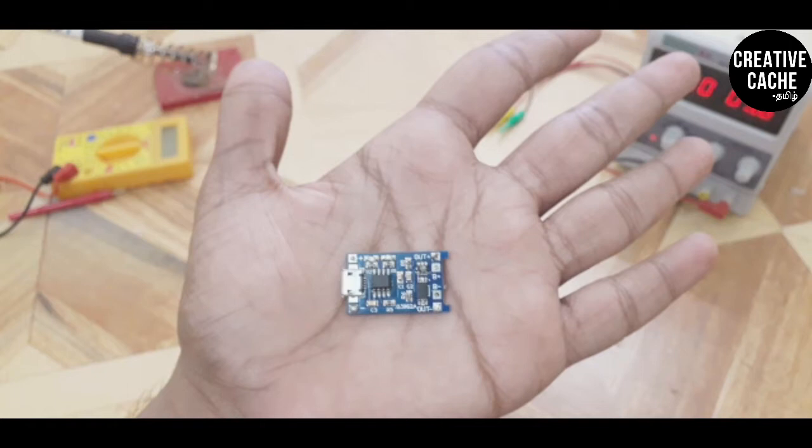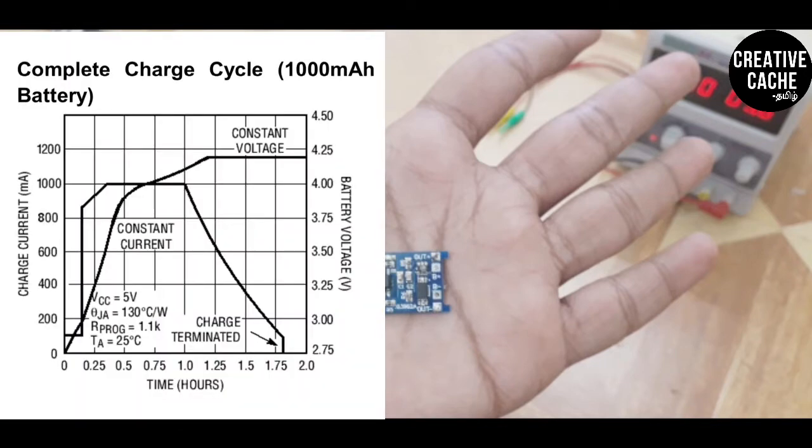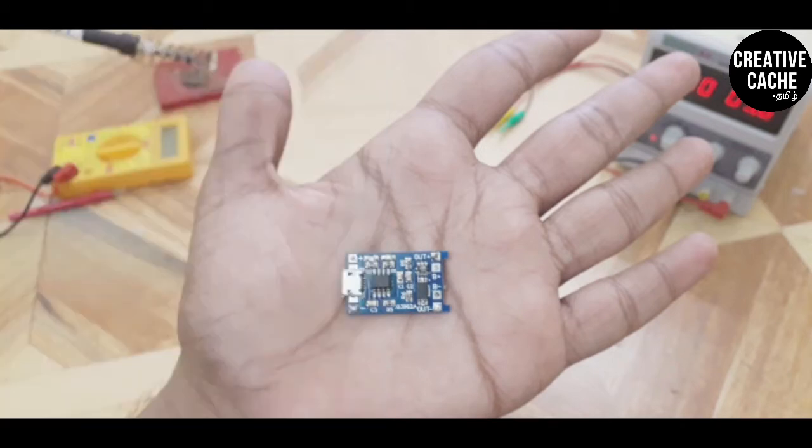Now, the voltage is a constant voltage charge. The battery will charge without any distraction from the device. There is a 4.2 volt charge voltage with 1.5% accuracy.